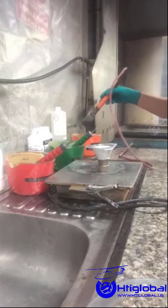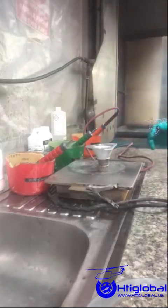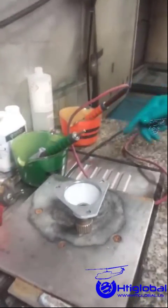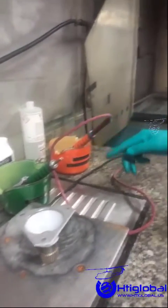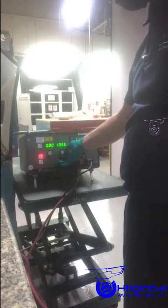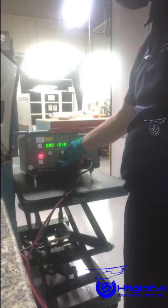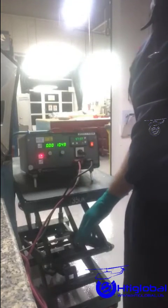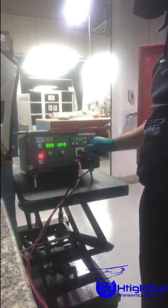Warning: during the whole process, make sure there is no grease or oil. Here you can see the three containers with the different solutions, and here below is the base where we will be closing the circuitry. In this other location is where we will be doing the bath of chromic conversion. We are setting our voltage to 10, which is the ideal voltage for faster evaporation and to control any undesired evaporation. Our device is set up in direct current. For the electro cleaning process, we will be setting our current to reverse current to prevent embrittlement in the part.